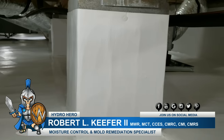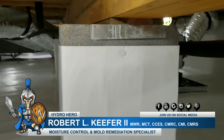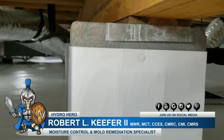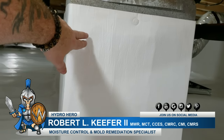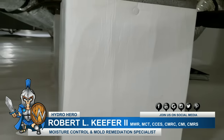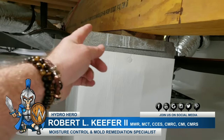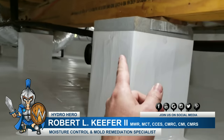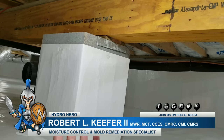So we've wrapped the pillars. We have our inspection gap — it's sealed all the way around so no vapor can come up from there. But we also have an inspection gap to make sure that any termite companies or pest control companies can look for termite shelter tubes. Extremely important.